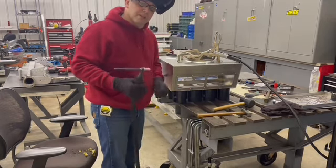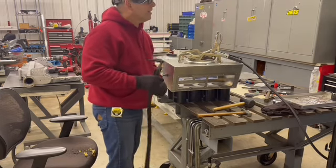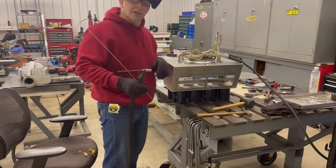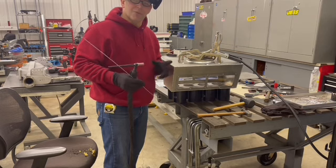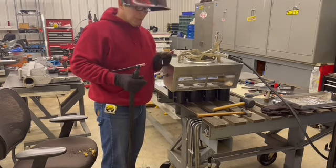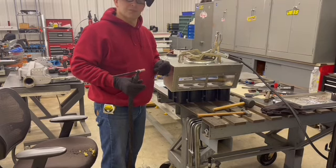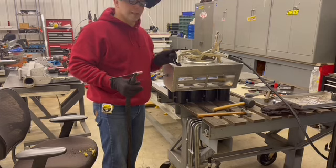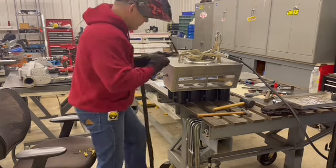There's a lot of different widths of wire, from 1/16 to 3/32 to 1/8. I used to do everything with 1/8 inch wire. I mean, if I was welding interior sheet metal in aluminum, I'd be using 1/8 inch wire. My brother always liked using this 3/32 rod, and it got me to using it. And I primarily use 3/32 rod now on anything that's relatively thin sheet.